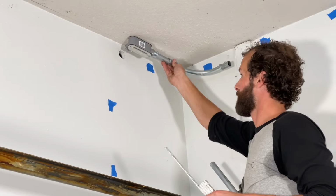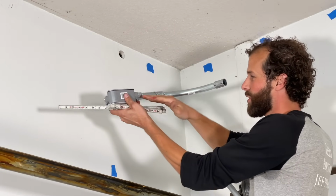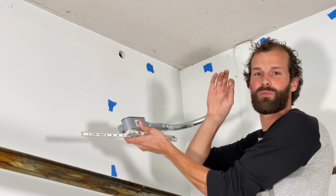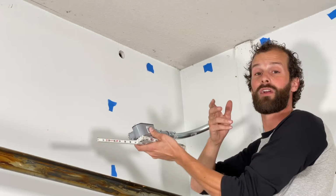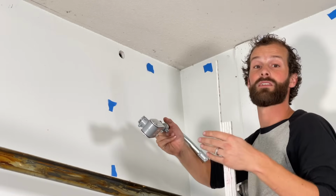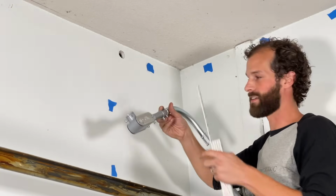All right, at this point, I'm running my conduit around the perimeter of the room. One of the marks of an electrician is that you're going to orient all of your screws on your fittings in the same direction. That's just little marks of professionalism. And when those marks aren't there, home inspectors, city inspectors all get a little bit more suspicious and your work starts getting scrutinized unnecessarily.